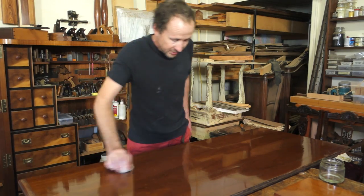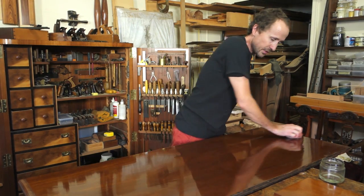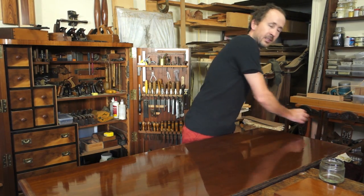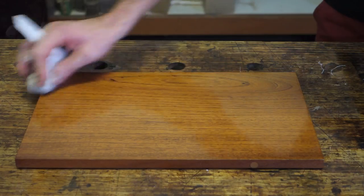The next stage after this is the burnishing stage — or if you're happy with it, you could just leave it at that. But I like to burnish it; it just gets rid of any residual oil and gives you an extra nice level of sheen. Thanks for watching everyone. I hope this short video has given you some good information in regards to French polishing. The main thing is to get out there and have a go at it. Experiment, try on a sample board, and don't be afraid to wash it off and start again or cut it back with abrasives. It's an amazing process that can achieve an excellent result and well worth persevering with. Once again, thanks for listening.